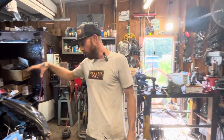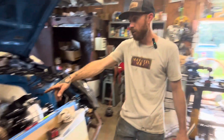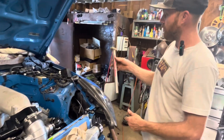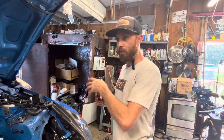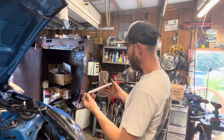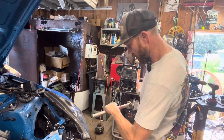Today we're starting on the other side of this. I want to start documenting more of how we did this side right here. The first step is I have to mount this little flange — this is actually like an elevator handrail, stainless elevator handrail — and I made a flange out of it, welded on this schedule 40 half-inch diameter pipe.